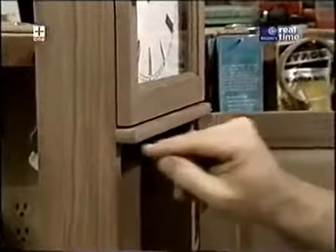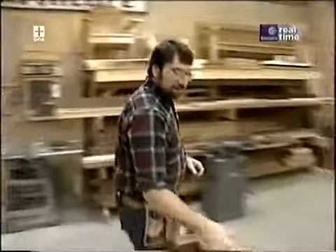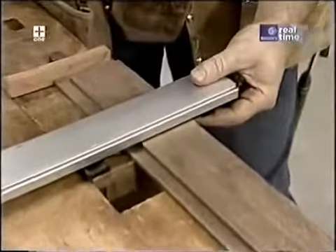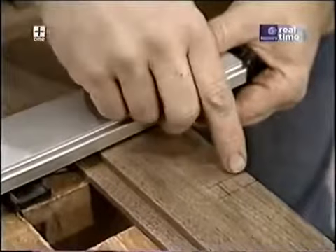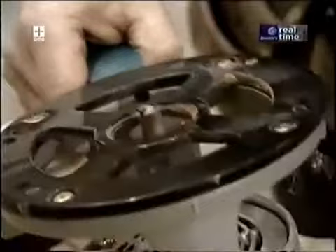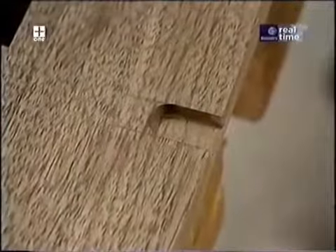There's one more milling step to do to the side pieces: this half-inch division rail needs a little dado that it can sit in so it'll be firmly set in place. I'll do that here at the workbench. I've clamped the side firmly in place and I'm using a straight-edge clamp to guide my router to remove material in the layout area. The router is set up with a half-inch straight cutting bit.